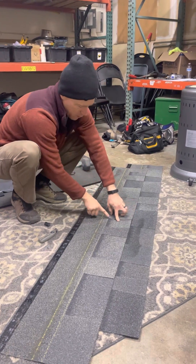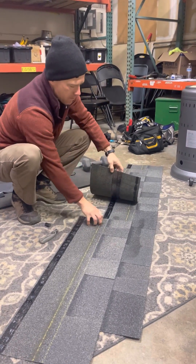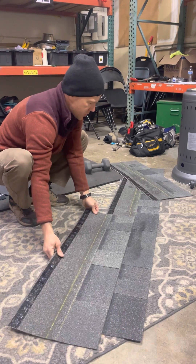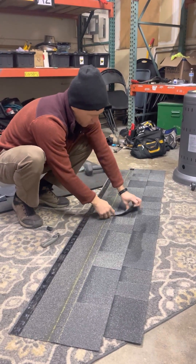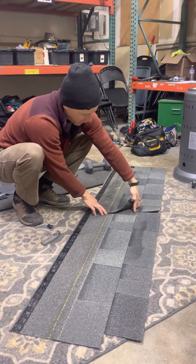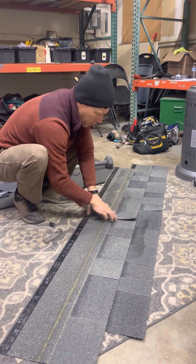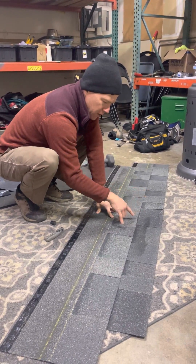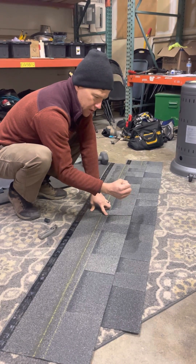Water will get into your keyway and travel a little bit to the left and a little bit beneath. When water comes into the keyway, it'll drift over and get underneath these shingles — that's when it causes a problem — and it'll find a nail right there. When you form a keyway, imagine water getting in and traveling three to four inches each direction. You can't have fasteners — nails or staples — where that water is traveling, because it'll rust them out. Then the nail shrinks and starts leaking.